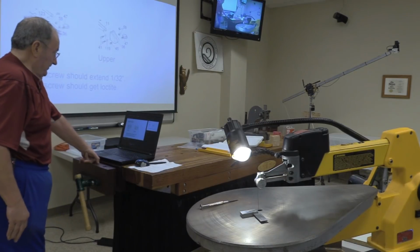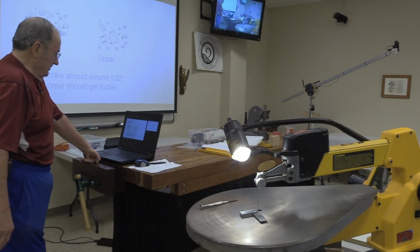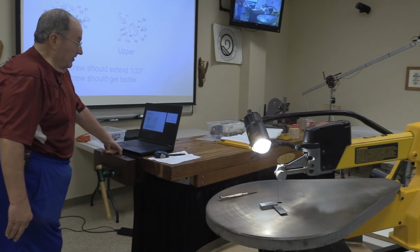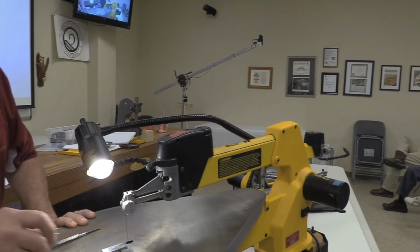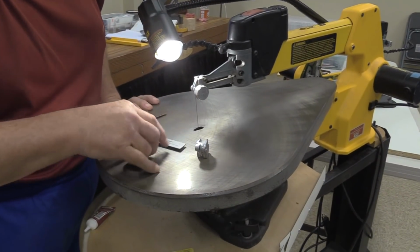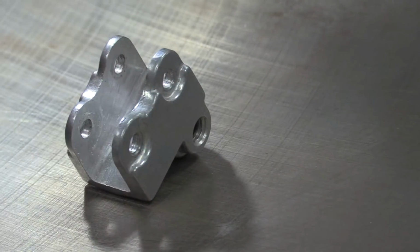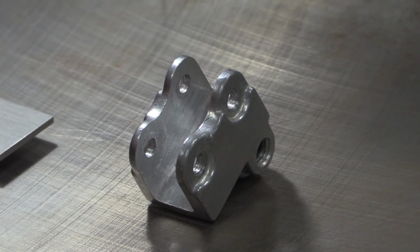Let's talk about some blade clamps. This is one of the things that we seldom pay much attention to until they don't work. There's a fair amount of hardware there to hold that thing in place. But what we're talking about here is a simple casting. It's got a pretty good amount of machining going on to cut this slot out here so that it goes on these rockers and the strut that holds the other end of the rocker in place.